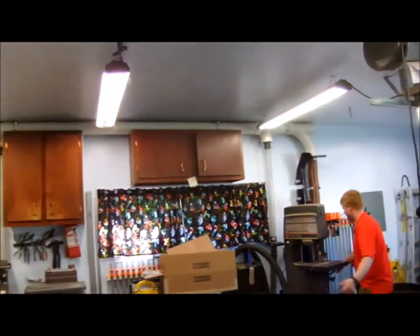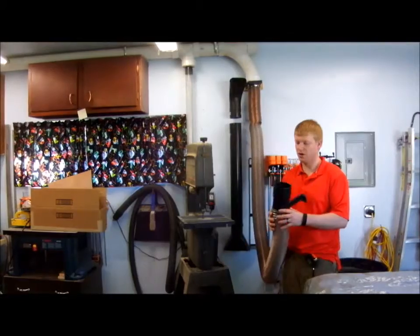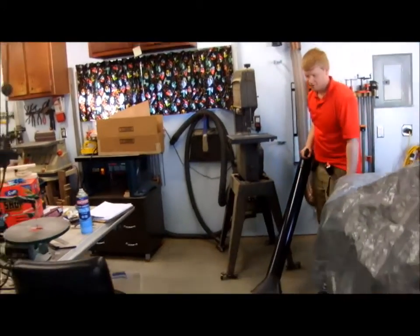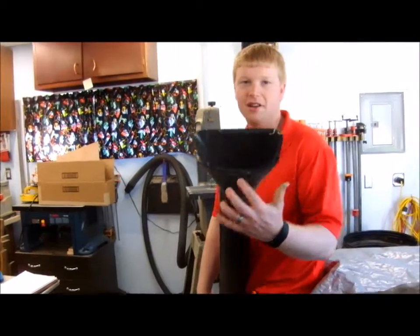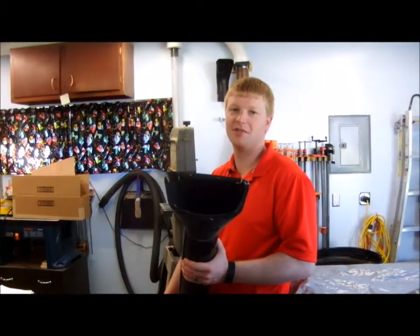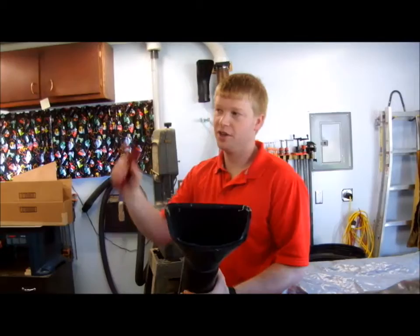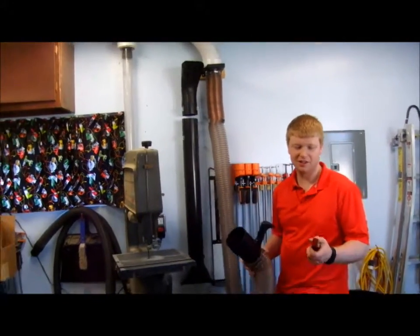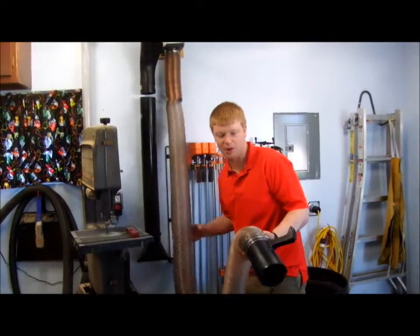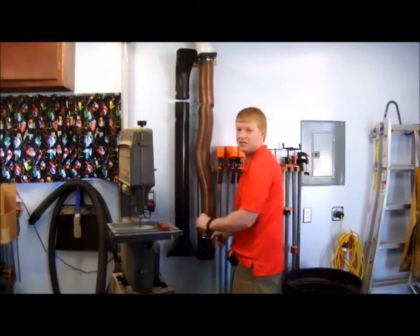Down here I have the final 4-inch dust collection tap, and this is the one I use mostly with my table saw, my jointer, or other big equipment. Right behind the wall next to it I have the Rockler Woodworking floor sweeper. One modification I had to make is that it had a plastic screen inside — that plastic screen you couldn't suck up anything, it would just clog it up instantly. So I decided it wasn't worth having, even though it is a bit of a safety feature. I left a screen in right before the blower so should I suck up something large that can't go through the impeller it will get caught at the blower. Sometimes I'll use the suction from the machine to help hold up the hose, and it actually does help a bit.